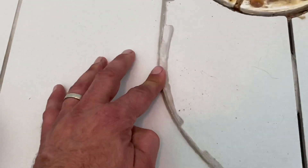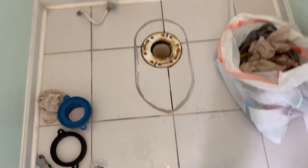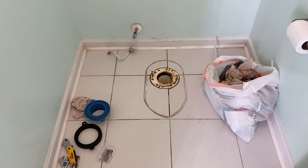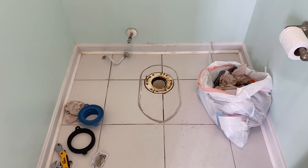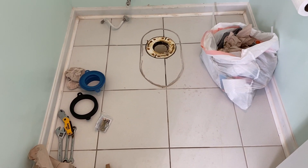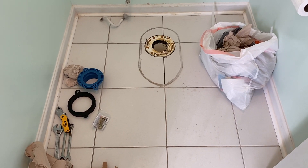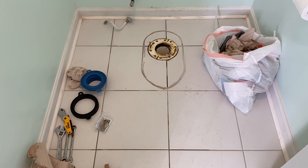You can see this toilet — I thought this was caulk, but it feels like grout from the tiles. I see a lot of people will caulk around the toilet. I don't know if they think that makes it look better, and I guess it does kind of finish it up. But to me that's a terrible idea, because if that toilet gasket starts leaking, you're not going to know it until it rocks the floor out and gets soft. If it's leaking, I want to see water out on the floor. So I never caulk underneath there. Now that's even got grout, so I'm going to have to get all that up somehow without tearing up the tile. My toilet's going to be a little bigger, so I have to get that out — it'll make the thing off balance.